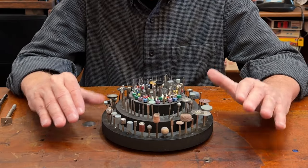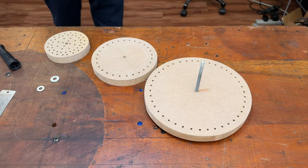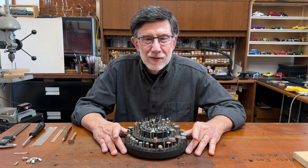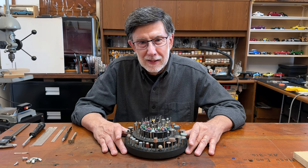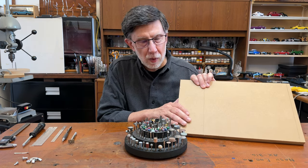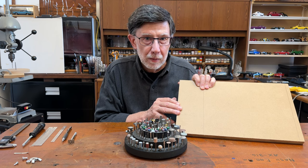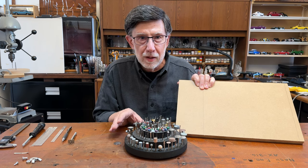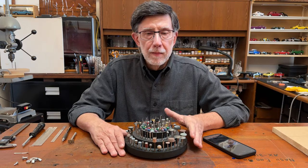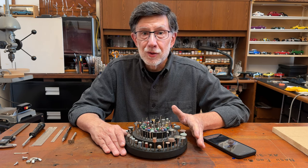This carousel is comprised of three layers — three discs. You can probably go and buy pre-cut discs at your craft store, either of wood or foam. When I made this, I had a lot of scrap particle board on hand from other projects. I really like particle board because it doesn't warp. It's sturdy, very solid, and it cuts and drills really well — it just lends itself well to this project. I started with a sheet of three-quarter inch particle board and made a rig with a center post to attach to my bandsaw so I could cut perfect circles.